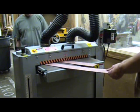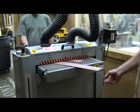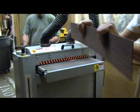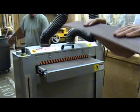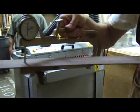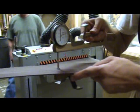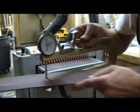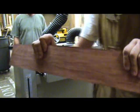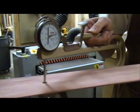All the sides in this video have been rough thicknessed with a tool called a safety planer to approximately 2.5 millimeters or 98/1000ths. Initially, I'm not worried about the thickness of the sides. I test each piece for flexibility and sand it until the safety planer marks disappear. I'm using a drum sander with 80 grit paper. It's important to take very small bites, and it's also necessary to make several passes to arrive at your final thickness.